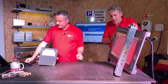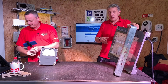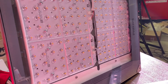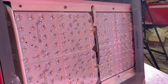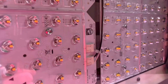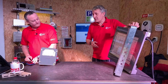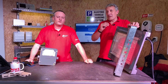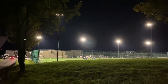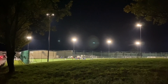What about the optics? They look completely different to what I'm used to seeing. Because normally on a floodlight — you go down to the wholesale counter, there's lots available — people buy by wattage and you've got this yellow square in the middle and some metalwork. There isn't actually much optical performance going on there. This is different with the CoreLine range, and that's probably what makes a huge difference when you start specifying floodlights — thinking about things like light pollution and where that light actually goes.